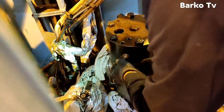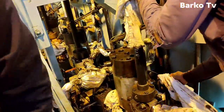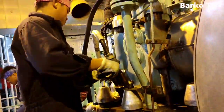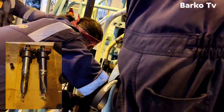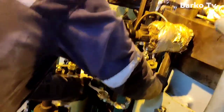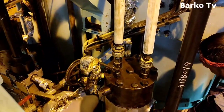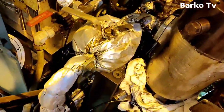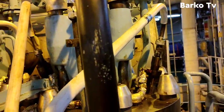That is the suction valve, and that's it — you already changed the plunger and the suction valve. Also change a new calibrated injector. Okay, tighten it and then ready to go. Shout out to our chief engineer Larry Loneta for teaching us how to dismantle the fuel booster — thank you.